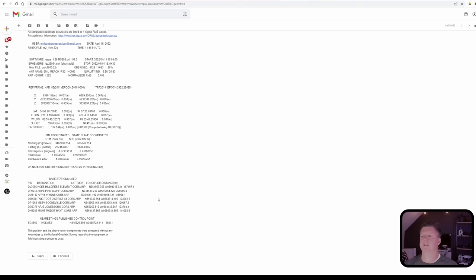And so the antenna height for the Reach, so when you use third-party software, the ReachView app automatically adds the phase center offset. So the 0.134, which is from the bottom of the antenna to the center, what's called phase center. And actually there's two, you have the L1 and L2, but they use the 0.134 as the value that gets added from the bottom up to the phase center. The ReachView app adds the 0.134 into the survey file.